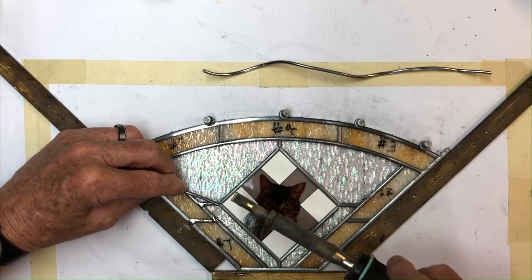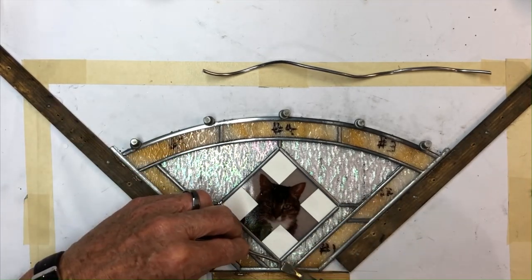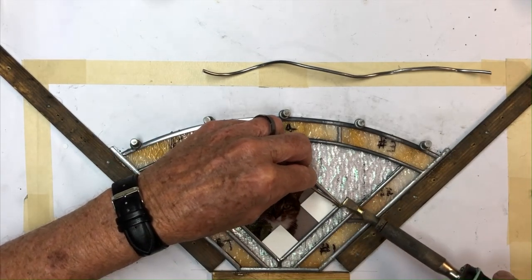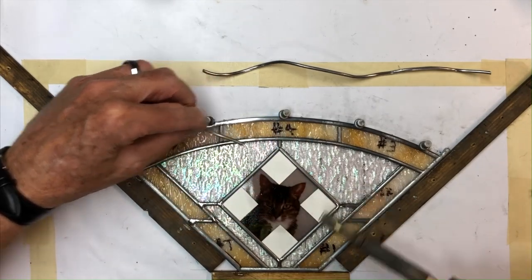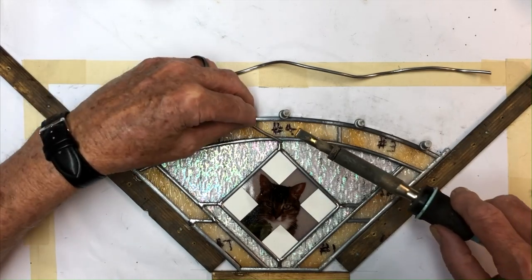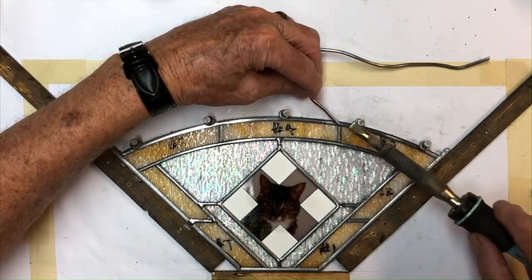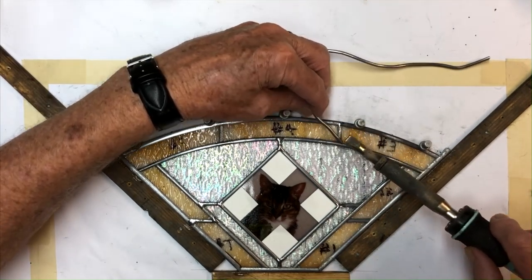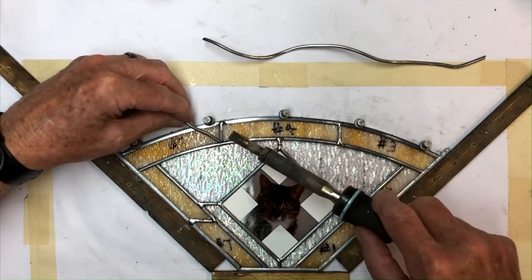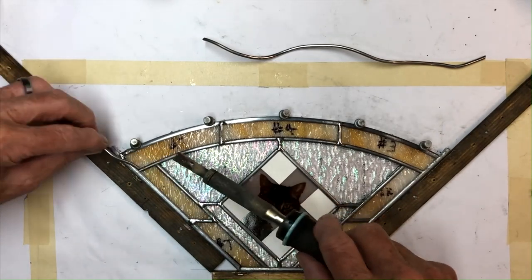This is the one where they have all the intersections. Just put it over here, take a little bit more, and solder the whole group at one time. If you notice, by doing it like I showed you on the lead, this makes a really nice looking joint. Just come up here and we'll solder these all up here tight. When you're soldering, it doesn't really make much difference where you start or where you move around.